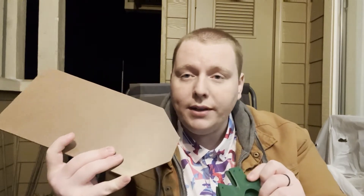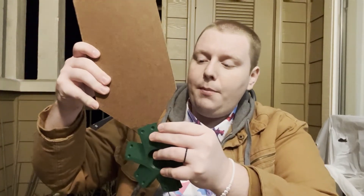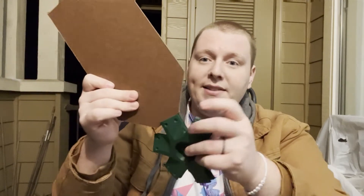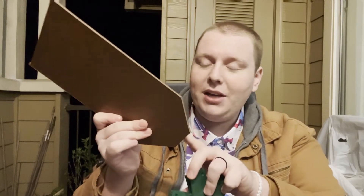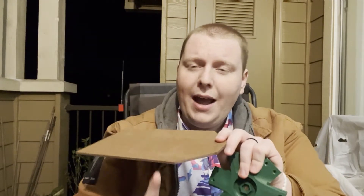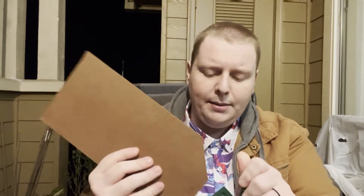I used to measure these out, print a little guide for where the holes would need to be, drill the holes, and mount them all at once. I don't do that anymore because if you don't line them up perfectly it becomes a problem. I found it's easier to just put them into the hub first, make sure it's more or less even, and if you have these little corner pieces cut out it makes it easier to find the center and prevents the blades from colliding when putting it together. Then I just stick them in and drill straight through the holes — no guessing game. Sometimes drilling through wood splinters it and makes it thicker near the holes, so I've been inserting them, drilling the holes while they're in one by one, and then fixing the screws in place.